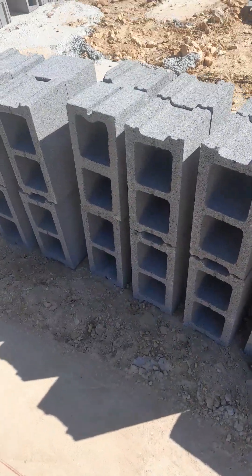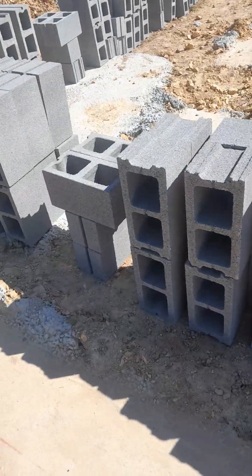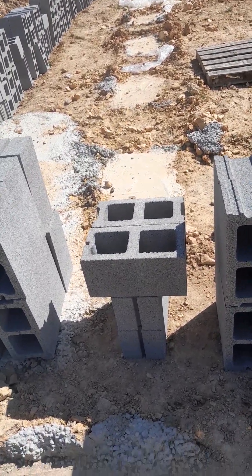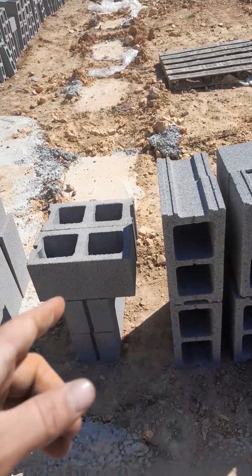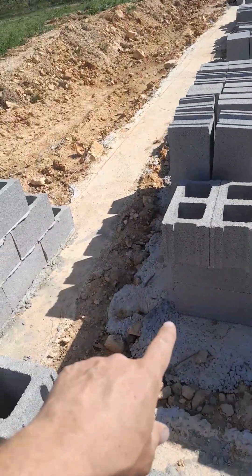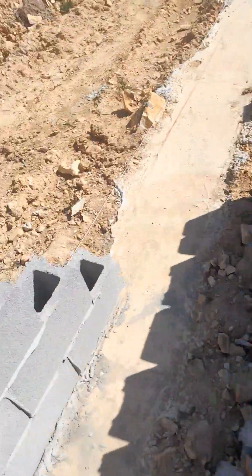This is how I like to set mine up — I go six inches between my mud boards usually. It's the same on scaffold too, except you always do three on one side and three on the other side of the scaffold leg that's supporting it. You never put the weight in the middle — you put the mud board in the middle of the scaffold, so you can use this mud board for both sides of this corner right here.